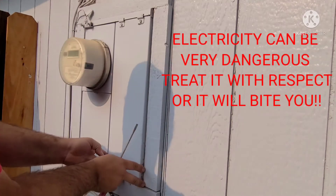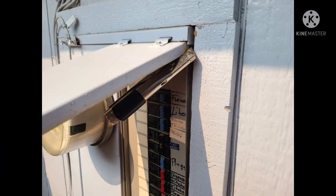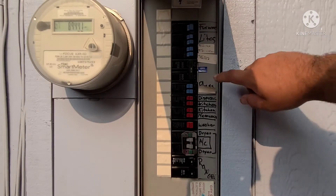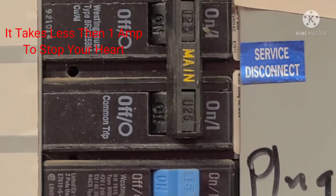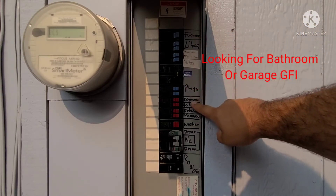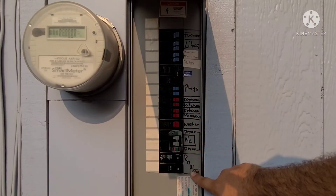The first thing you're going to want to do is check your main breaker panel for any circuits that have been tripped. A quick tip is to use a pair of vice grips to hold the door up, because it's no fun when it comes down on top of you. Scan down and look for anything marked like GFI, bedroom circuit, or bathroom circuit — whatever room isn't working.